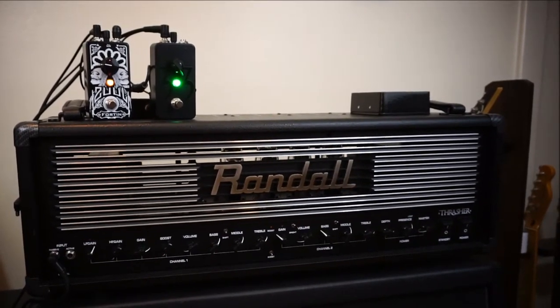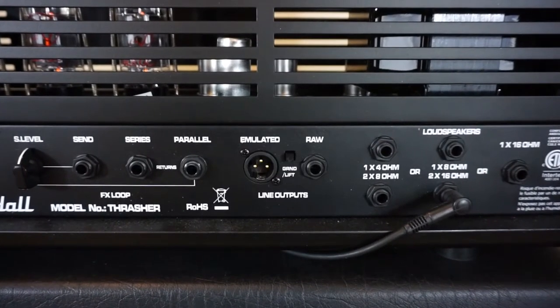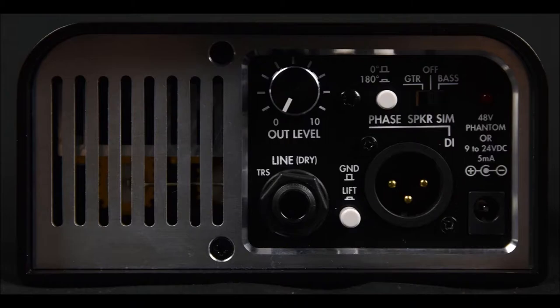If you want to take full advantage of this setup, I'd suggest having some type of DI box or load box solution that allows you to record silently. I do have a dummy load box, but it doesn't have a DI out. Fortunately, the Randall Thrasher also has a raw output tapped off the speaker jack at a much lower level, so you can safely connect it to other electronics. Unfortunately, I don't think this load box sounds very good compared to the real thing — the responsiveness and dynamics between the two are very different. If you have a higher quality DI box, like a Two Notes Captor, hopefully it'll sound a bit better. In my case, I'm just going to muffle the speakers and take the raw line output. If you don't have a raw line out on your amplifier, you will need some type of DI box to interface between your AX8 and amplifier.